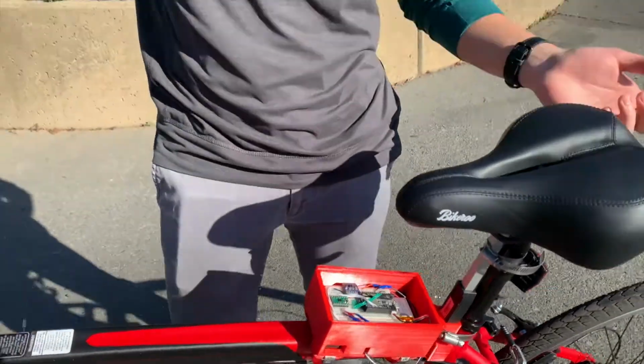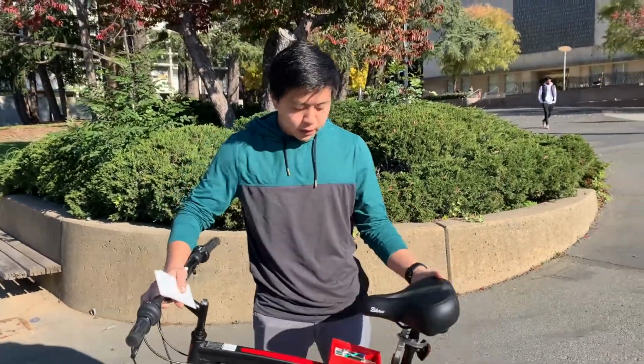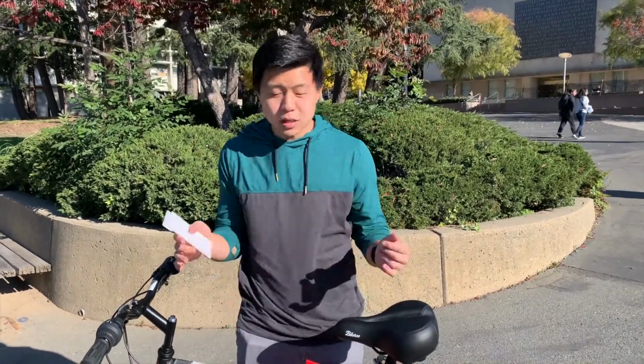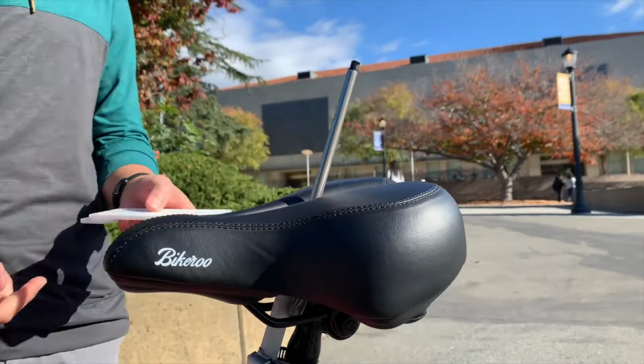So in running configuration, basically the accelerometer will start looking for acceleration past a certain threshold. Now this threshold was kind of set arbitrarily, but it's what we estimated a bike thief would jostle a bike at. So the catch though is the first jostle does nothing, because sometimes your bike just tips over or somebody else is trying to get a bike adjacent to yours. But after about 5 seconds or so, if jostles past that threshold are sensed again, then the actuator starts coming up, and it'll just run an infinite loop in and out of the seat.